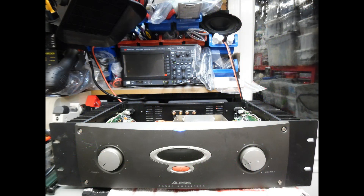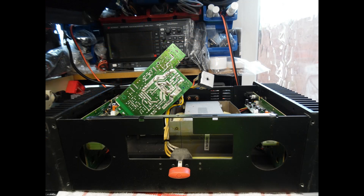Moving on, I'm showing the front of the amplifier, and this is not uncommon — you do see this fault from time to time. The plastic bezel is connected via four Allen screws left and right to either side. The front fascia has clips on the top and bottom of the chassis, so if you just press them lightly you'll be able to unclip it. The fascia comes away with the two volume control potentiometers, and there's a multi-core cable with a plug that connects to the power supply board. Once disconnected, you then need to remove the left and right channel connection leads from the power output modules.